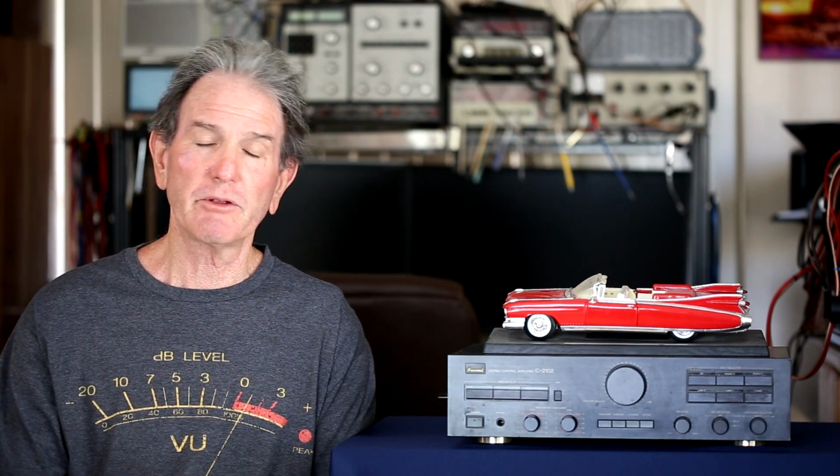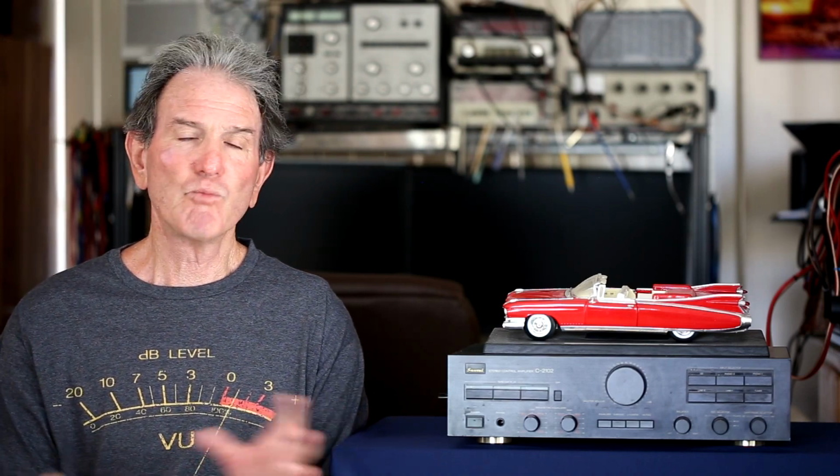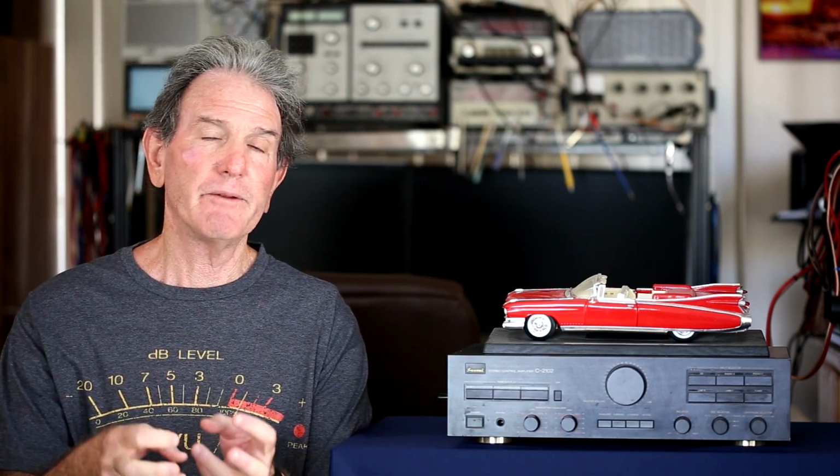However, it would have a sensitivity right at the spot which gave me 0 dB gain, and I could change the input signal to see if it was something further down the line that didn't like being driven that much. But no, it was definitely related to the volume control pot. Once I tried working that a bit more, and used a slightly different cleaner lube in there, that seemed to work fine, and I did all the measurements. But when I was all done, I remeasured it again, and it was still a little flaky. I thought it might be some solder joints where the connectors are wired to that volume control pot.